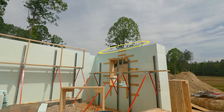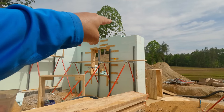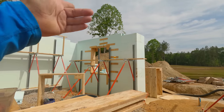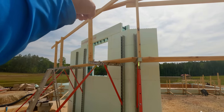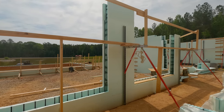Right, Tater? So we got that built up there with the 12 inch. You see those two? So I've got to cut down a corner. I'll cut 6 inches out of a corner from the top and the bottom, which will leave me nubs on one side of each. The middle part will be waste, and I'll fill those corners in. This one's got to go up one more level. We'll need a 45 that gets cut. That's the height that needs to be.